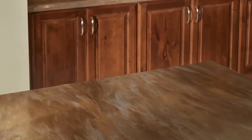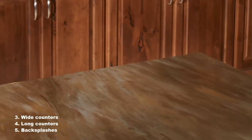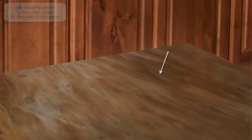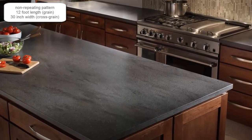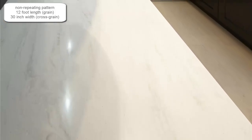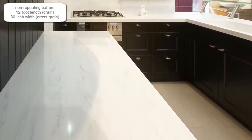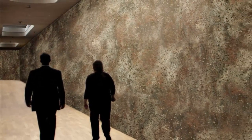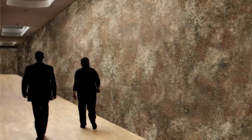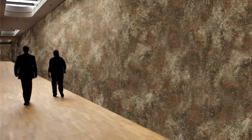The third, fourth, and fifth considerations also address seam placement. Although there are no tricks of the trade in dealing with wide tops, long counters, and long sections of wall cladding, it is important to understand seam visibility and clearly communicate seam placement in your drawings. The Private Collection colors have a non-repeating pattern that measures 12 feet in length and 30 inches in width. For island tops, conference tables, transaction counters, and other applications wider than 30 inches, consider your preferred seam placement. The same idea applies to long counters such as bar tops and food service counters, and is equally important on wall cladding and backsplashes. Be sure to communicate your preferences before the bidding process, as there are always chances to reduce cost after the bidding phase, but it is very costly to add or clarify features after a contract is written.